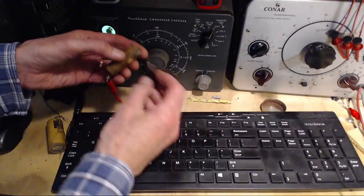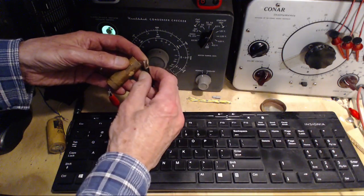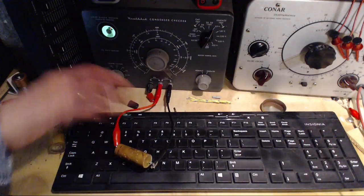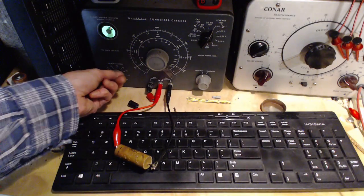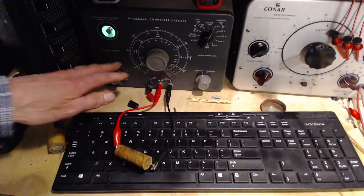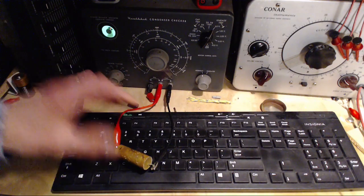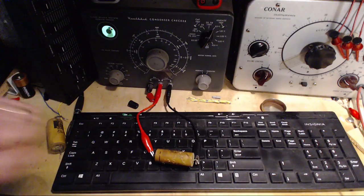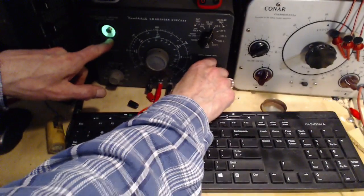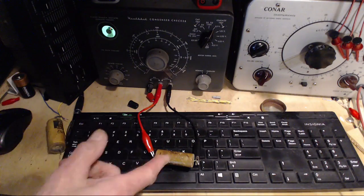Okay, put your wagers down. How many want to bet this is a badly leaking capacitor? Now it's electrolytic, so they're all leaky. So I flipped this switch. Oh my god, it was already on electrolytic. It's the most problematic switch on this instrument, remembering this switch setting. So we're on electrolytic. I'm going to check with 50 volts across it and watch what the eye does. It just popped open as if there's no capacitor here.